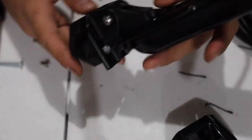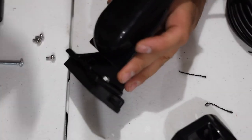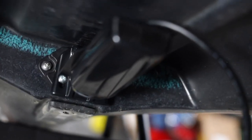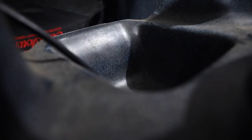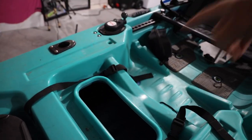Now, where those spiders were when we pulled off that mounting plate, we're literally just going to go put these two screws back in and then we've got our transducer mounted. All I'm going to do is put two screws in here and just like that — pretty dang flush with the rest of the kayak. I think we're in a safe zone here. Now we're going to take the other end of the transducer cord and start pushing it through and grab it on the other side. So we got all the cord through. Going to put it in through the hole — there are little chambers that go through the back, and that's basically the key to not having to drill any holes in the kayak.